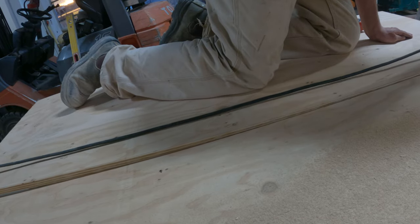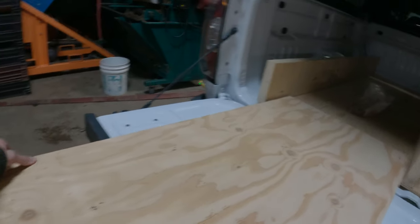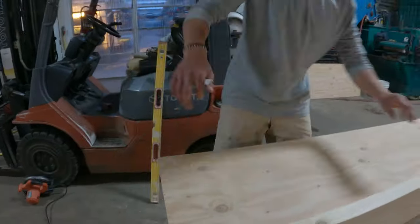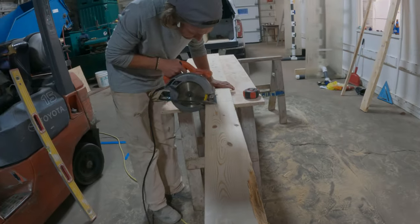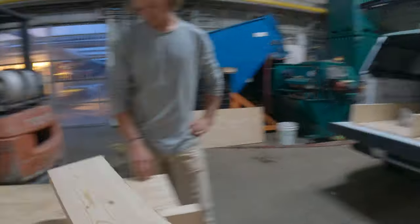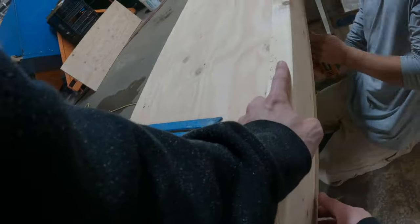Now this is cutting the three-quarter inch piece of plywood that'll be on top of those 2x8s. That will be the surface for the bed, as well as the spare piece of plywood will be the bottom of the drawer. Now we're literally just cutting to fit on top of that. And now we're building some of the drawer parts — this will be 2x6s on that piece of plywood. We're literally just going to drill it from underneath through the plywood into those 2x6s in basically a box, and that will be my drawer under my bed. It's the most straightforward design and also pretty sturdy.